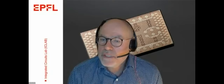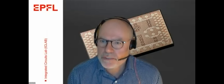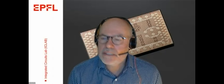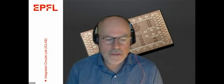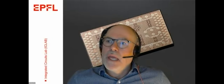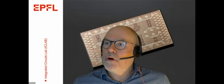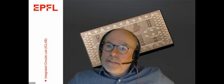So what we plan to do is, as soon as we get the probe card, we'll be able to do many more measurements, starting with single device measurements, N-type, P-type, and then constitute a database that should be made available. The next step would then be to improve the models, so maybe redo the extraction and improve the models for that technology. Well, and I would propose that we use EKV 2.6 then. We can try to do that and see what we get.